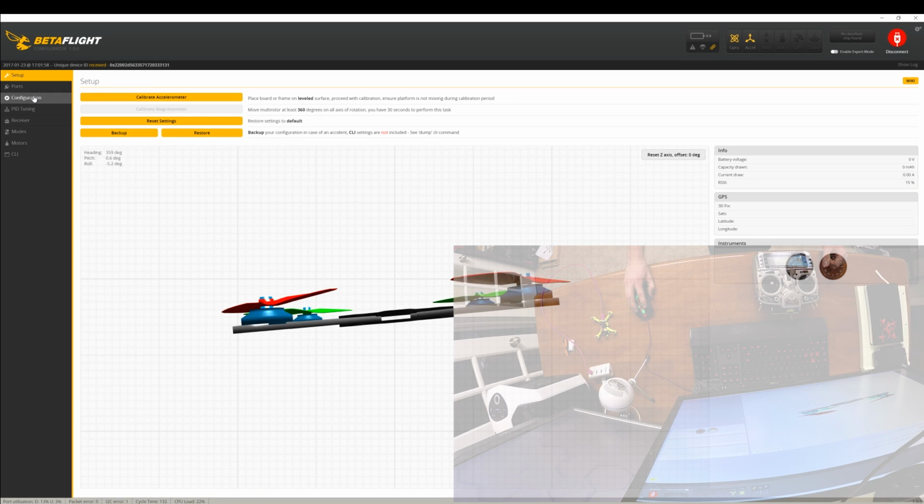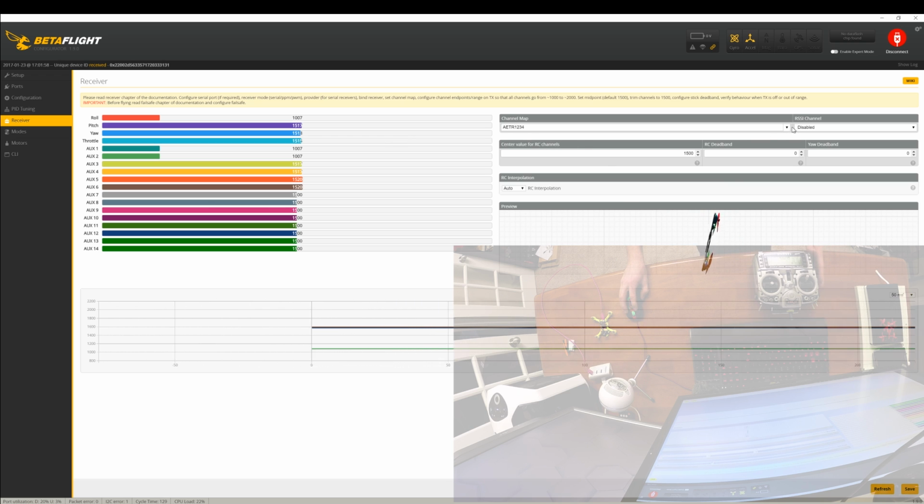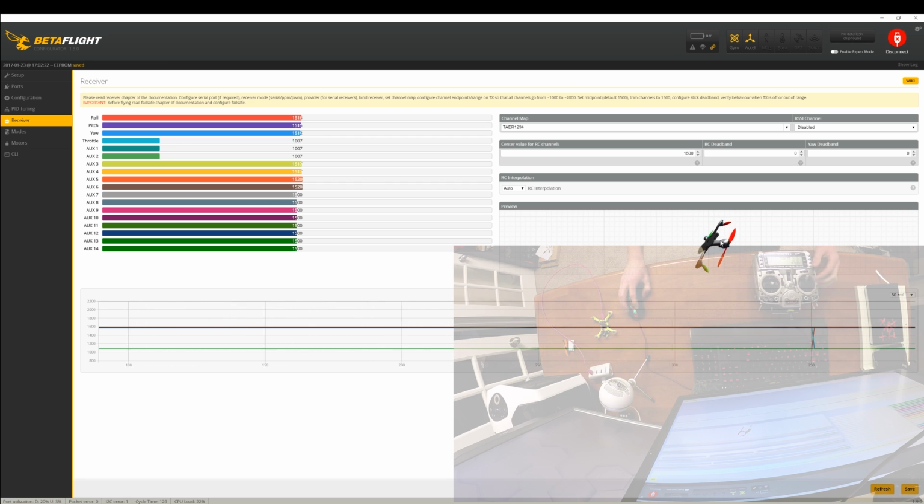Alrighty, now we'll skip PID tuning for right now. We'll go to receiver, and you can see here that our quadcopter is wildly spinning out of control. And that is because the channel map is AETR. Now, that is not our channel map the way we have this set up. This is set up with the Graupner TAER. So once that's changed, we can click save, and bam, it locks in.